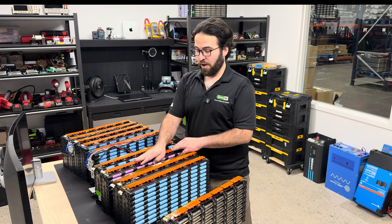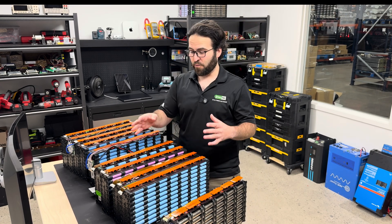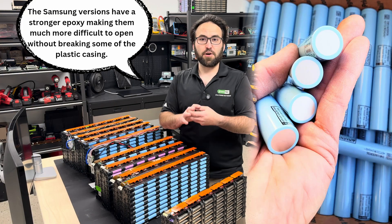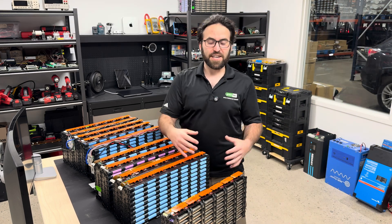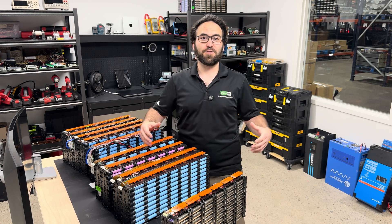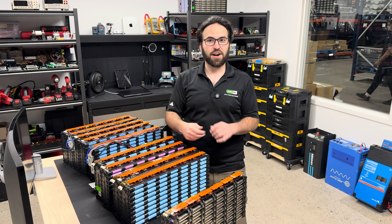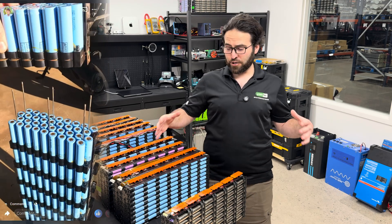This one is great for more mobile applications like electric vehicles, scooters, four-wheelers, or whatever you want to do. All of the eMatrix modules use spring contacts, so if you want to disassemble them, the cells come out completely loose — they don't have any spot welds on them. If you want to reconfigure just the loose cells into a 10s configuration for a 36-volt stand-up scooter, or a 20s configuration for an eBike, you can use your new cell spacers and new nickel strip and then spot weld right to them without having to clean anything off or tear anything apart. It's a super easy way to have a ton of 18650s for your own pack.